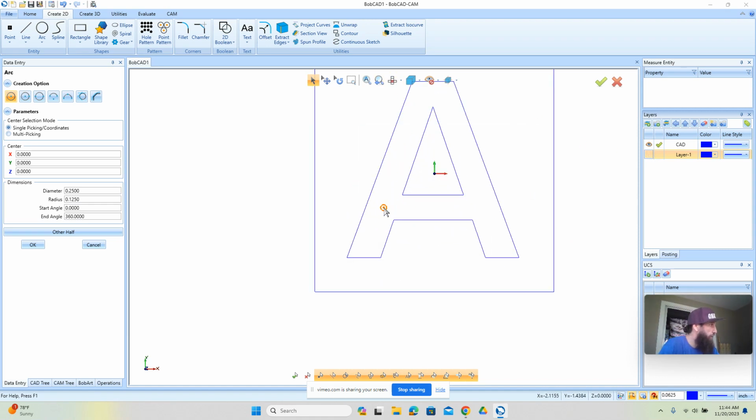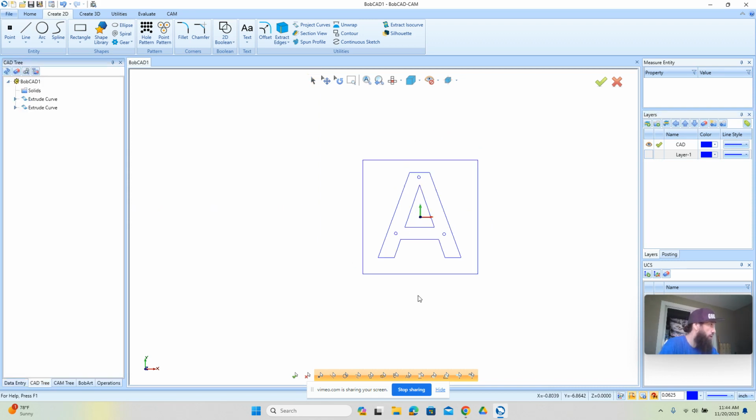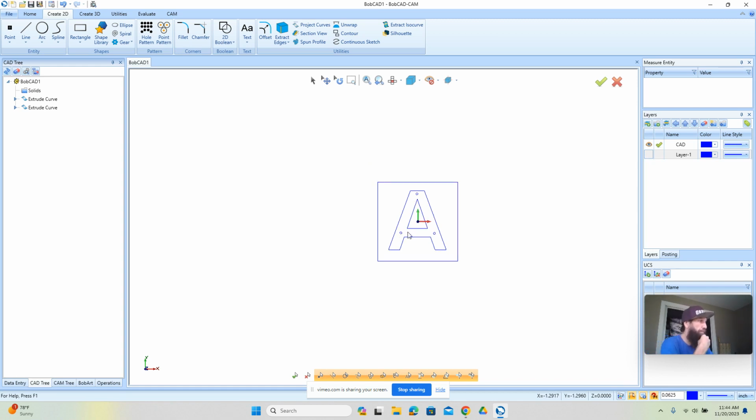And then we can just pick a couple of locations. Now, this letter is a little bit bigger, so I'm going to use 3 pin locations, but maybe you just use 2. The whole point is just to support the letter. So with long, thin pieces, make sure we have some extra hole locations, making sure to support the letter on the back. All right, now when we cut this out, we're going to mirror it.